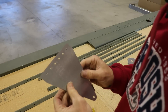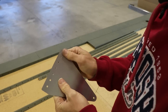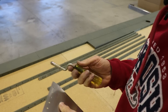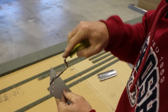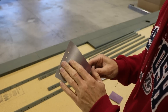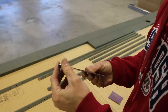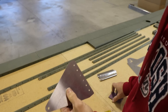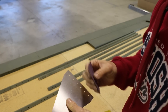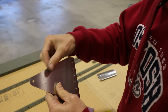The first thing I'm going to do to get my parts ready is to feel all of the holes in the parts. A lot of these holes do not need deburring — they're really smooth — but every once in a while you'll find a hole with a burr on it and that should be removed. You can do that with a tool like this: just put it in the hole, give it about a one-turn spin, and you'll take the burr right off. After I check the holes, the next thing is to check the edges for any burrs. Most of them are very nice, but just like the holes, every once in a while you'll feel a little burr on the edge. If you do, just take a piece of 400 or 320 grit sandpaper and go over the corner a few times for a nice smooth edge.